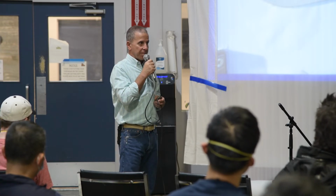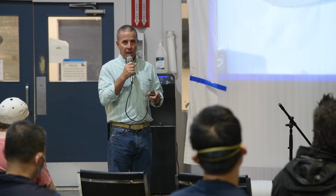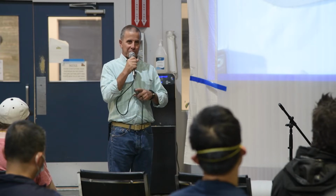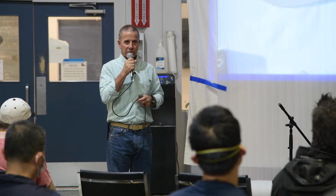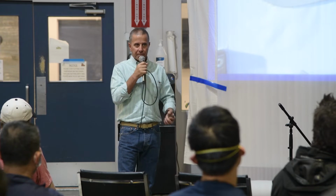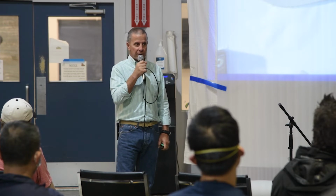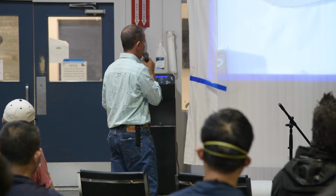I can tell you that for painted aluminum issues, for failures in the paint, 95% of the ones I see originate at a penetration where there's a fastener or a piece of hardware. In the other 5% of the cases, it's a scratch or a nick that causes the failure. It's very, very rare to have the paint lift or blister for no reason. You know, just because it has lost adhesion between itself and the aluminum, there is almost always a causative factor, which is, again, a breach or a penetration in that coating. It's no longer contiguous.